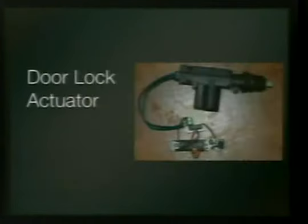So we're using a relay, which is the little chip on the little perf board. And as we send a 5-volt signal to it, it'll say, okay, turn the switch on, and then it'll take 9 volts out of the 9-volt battery and make the thing shake. You're supposed to use 12 volts for car stuff, but it seems to work.